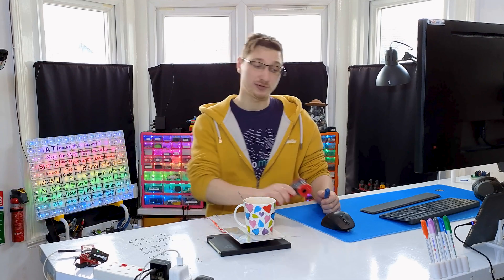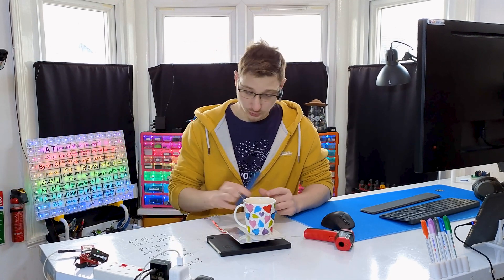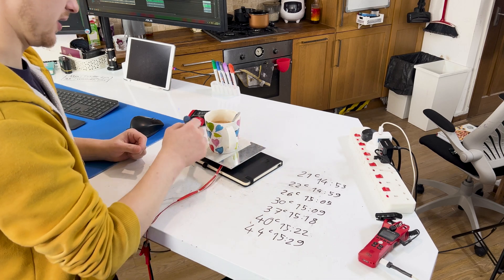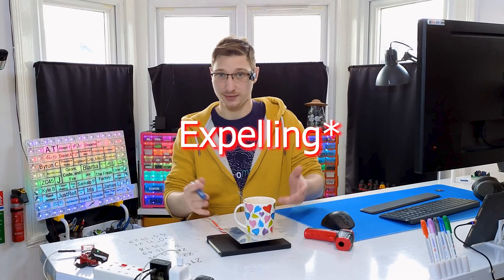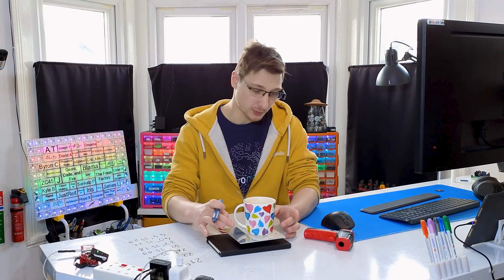The plate itself is at 135 degrees so not the greatest heat transfer, but I think some of that is due to the fact that there's a lot of metal here that's just spreading the heat that we don't really need. So I'm probably going to end up just cutting this bit down just enough to hold the mug and whatever mounting method I end up using for it.